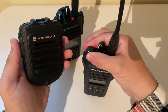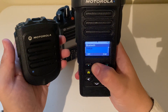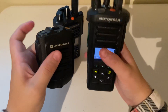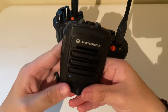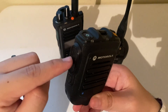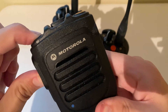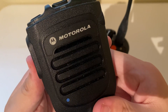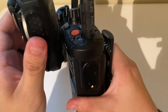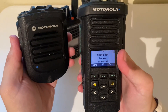So for example, we'll turn this on and scroll over to Bluetooth, make sure that's on — which it is. So we'll exit that and go ahead and turn on this RSM. What I like to do whenever I'm pairing a new RSM with a new radio is reset it. You hold the power button and the push-to-talk simultaneously, and you'll hear the following voice prompt: 'Motorola Solutions, power on, cleared, touch blue dots together to connect.' After that, you take any radio with the blue dot and touch them together — and it says 'Connected.'